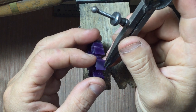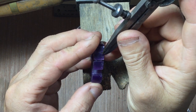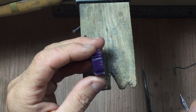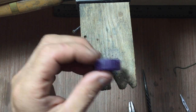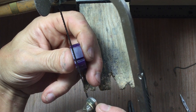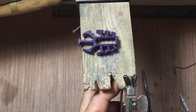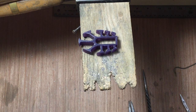You can see how much extra space I have. Each time I cut one of these I'm going to cut a little wide of the line — I don't want to cut into my overall thickness. I want to stay on the left side of the wax. I'm using a coping saw blade, not a spiral blade. It's very difficult to cut straight with a jeweler's skip tooth or spiral blade — they're good for hacking but not for cutting.